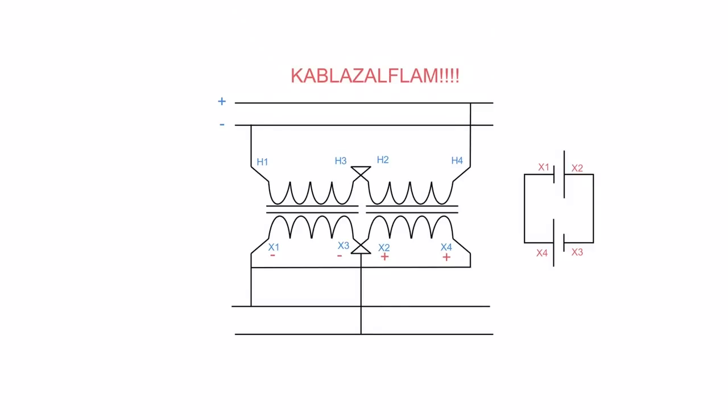Again, as I stressed before, on the primary side, it is all about the direction of current. On the secondary side, it's about the instantaneous polarity. When you're dealing with instantaneous polarity, you determine the line polarity. The line polarity determines the primary polarity. The primary polarity determines the secondary polarity, and that determines how you connect it down here. In another video, there'll be a test called the voltage closure test to determine what your voltage is that you're going to read here so that you know that you have a safe connection. So make sure you check that one out.